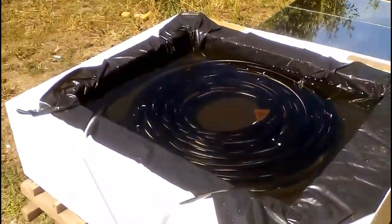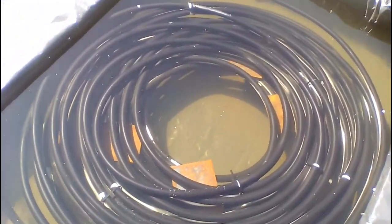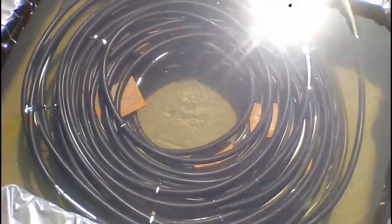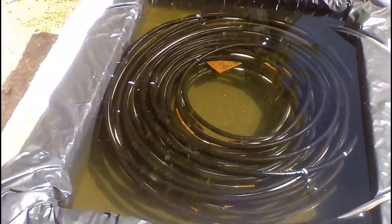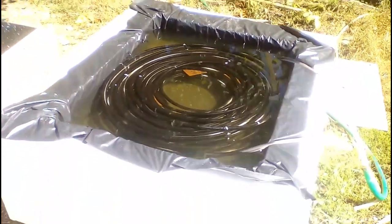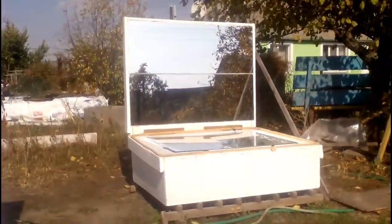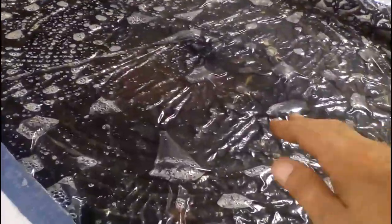I also want to clarify that my heater was filled with rain water, because ordinary water can be a source of salt on the surface of the black and transparent films, and the salt will decrease the efficiency of the heater. I drew your attention to the requirement that the surface of the pipe should be black, because it must absorb solar radiation well. My main goal was to study the energy capabilities of this type of solar heater, and therefore this video does not describe the features of the real design. For example, these air bubbles decrease the efficiency of the solar heater, but the decrease in efficiency is small, and we see that the bubbles are easily removed.